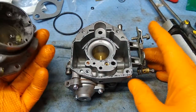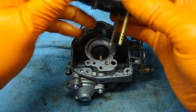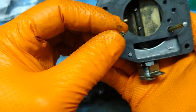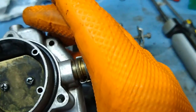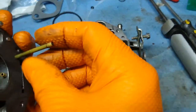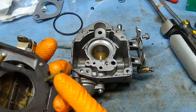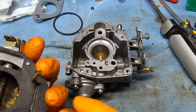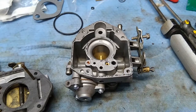These carbs are made in Japan by Nikki. Anyway, I dropped that back in there. All this stuff needs to be sparkling clean — there's an actual hole at the bottom. If you spray fluid in here it comes out of that tube. The chem dip did the cleaning, but I did have to put a pipe cleaner down here because it was so plugged the cleaner wouldn't make it through. That took a little extra work.